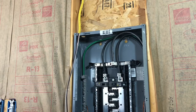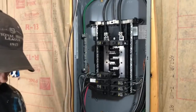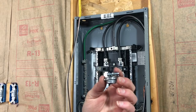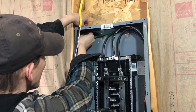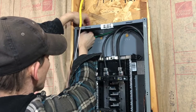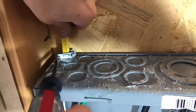This is a typical strain relief fitting. It's marked as a 3/8-inch trade size for a half-inch knockout, but the actual knockout on the panel can be slightly larger, so it's sometimes hard to know exactly what you want — but for these small knockouts that's the correct fitting. If you look at the knockout closely, you have the screws that hold down your cable and then another screw on the back that holds the fitting into the panel. You separate the two halves and screw it back together while it's in the panel, then feed the cable through the fitting and tighten the screws to secure it.